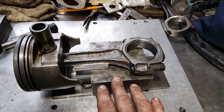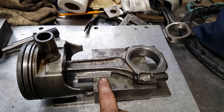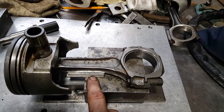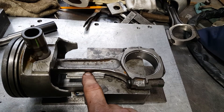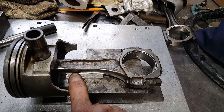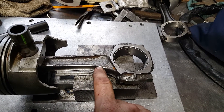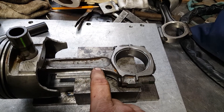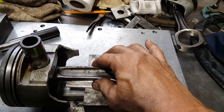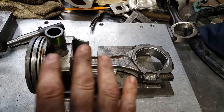In order to support the rod as you press it out, it's got to be flat and you have to have shims in here to support it. As you press down you're going to put stress on the rod, and if you don't have any shims you're going to bend or twist the rod. You can't put shims under the rod where it rises up — there's a little indentation that stops and starts to rise, so you have to cant the shims out a little to make sure they're flat. This evens out the stress so the rod won't twist or bend.